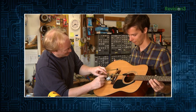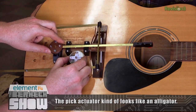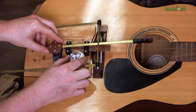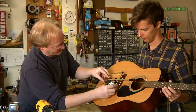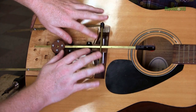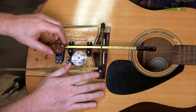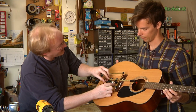So this is a rack and pinion. The rack is the long part with all the teeth in it. The pinion is the gear that moves it. This advances it forward, and then there's a slope portion here which raises the pick. When you go back, it lowers the pick, causing music. The downward pressure here pushes against the body of the guitar, which can sustain that. If we just had an arm on a servo, this downward pressure would eventually strip the gears, especially if they're plastic. These are metal gear servos, but it's still better to use the body of the guitar to receive the force.